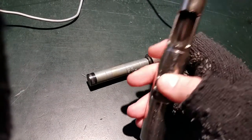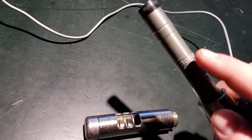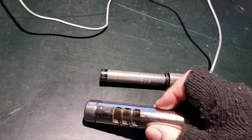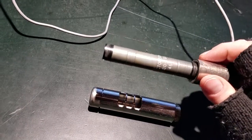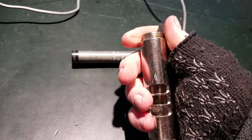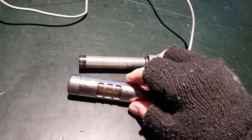An interesting thing about this Geiger-Mueller tube is there's a thinner area versus a thicker area. When the beta shield is open, lower-energy beta particles can more readily penetrate the tube through that thinner area — it won't block as many betas so they can get through and be registered. When the shield is closed, that doesn't matter because most beta particles won't penetrate the nickel and brass, though some really high-energy betas might get through.